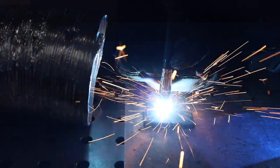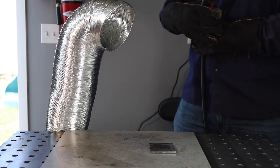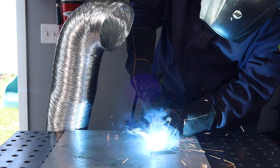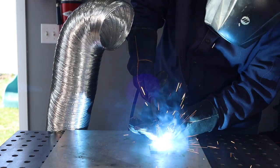This is working great for stick welding, but if I'm going to be MIG or TIG welding I don't want this much airflow down at the point of the weld because I think it'll interfere with my shielding gas and pull it away. To make this work for a MIG weld, I've positioned the inlet up a little bit higher, pointed sideways. My hope is that the fume will rise naturally off the weld and then get drawn in and sent outside. To exaggerate the amount of fume, I've rubbed a little cooking oil on the surface of the steel plate. You can see the fume naturally rising off and the majority of it is getting drawn in and sent outside, just as expected.